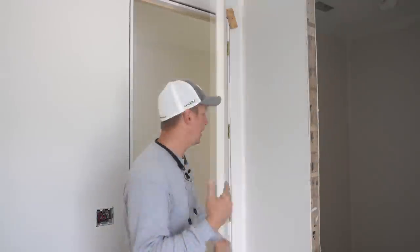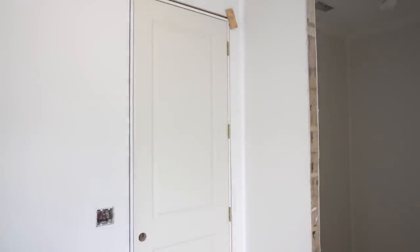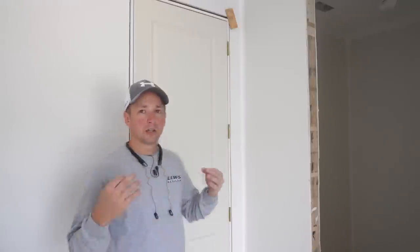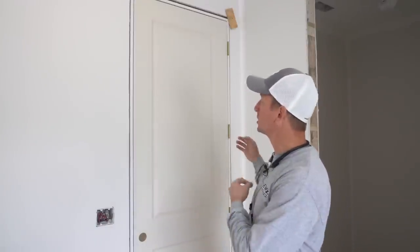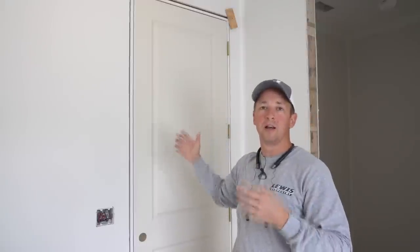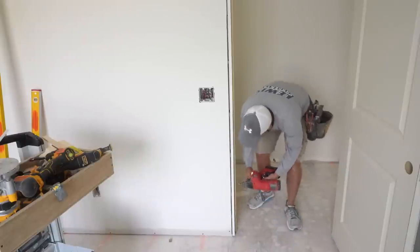One thing to keep in mind: if you watch a good experienced door installer, they're constantly going to be closing and opening the doors. You're constantly checking your margins, checking to make sure the door is still closing nice and tight to your doorstop, and checking to make sure your mortises are aligned. Check and recheck — don't assume. The reason is we all get on cruise control and miss things. I could have easily got going and realized I forgot to align the strike side of the jam and ended up with a huge margin up top. So always be checking and rechecking as you continue to fasten things permanently.